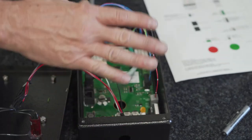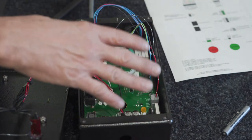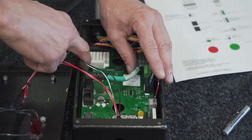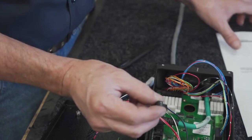What this does is it keeps this board and the sensor active, so if your generator shuts off on an AC tower, everything stays active to give you your elevated cab warning. The last pin is just the black 3-pin connector. It goes over here. There is nothing supplied from the tower for it. It is simply your tie-in to your truck elevated warning.